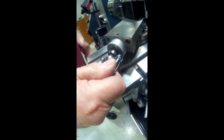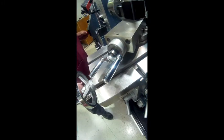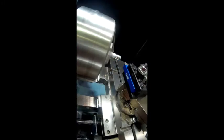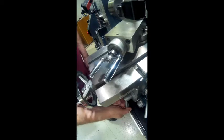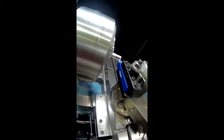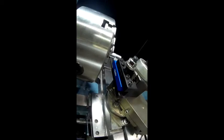Let's go in here just a little bit. We're going to turn the machine on, wait for our threading dial to come around to one, and engage to make a cut. Two and a half, two, one and a half, and one. Watch your cut real close, get to the end and disengage. There's our first pass on our thread.